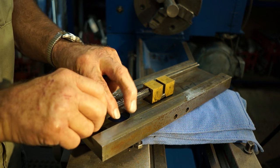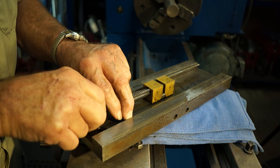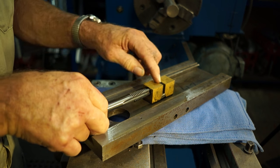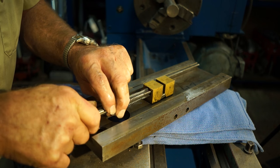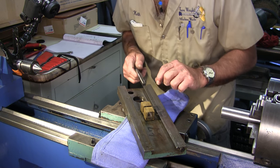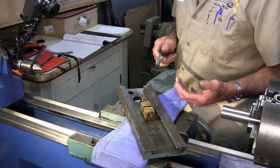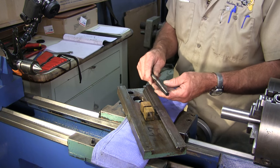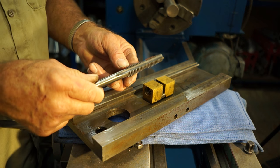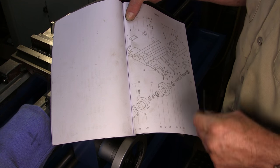That's what we're going to be using this tap for — to go ahead and make a new set of nuts. That's the starting end of the tap and this is the finishing end. Looking at the threads inside, they are pretty thin-walled and I even see a little peeling off on that one in there. We'll get closer shots when we're ready to make those nuts. We're going to machine two blocks, bore or drill those out, and then run the acme tap through.